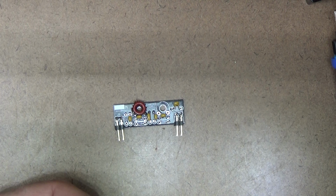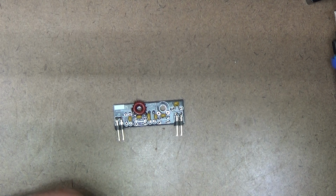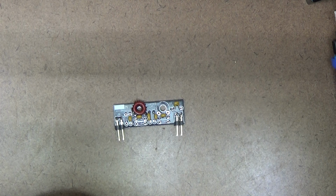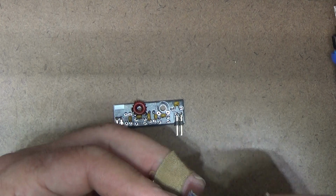Then again, if you've got 17s, 15s, and everything else, you still have the same problem. Anything 20 or above would have yellow toroids on it. So I'm just going to get close to the bottom of the toroid with my knife, just to start that enamel peeling. This one is going to wrap around, so it's going to be a little bit further out. I can pull it up and then get to it a little bit easier. Then I'll go get my sandpaper.